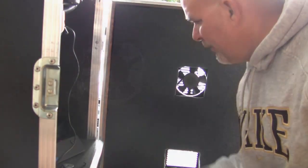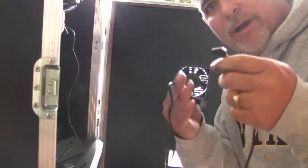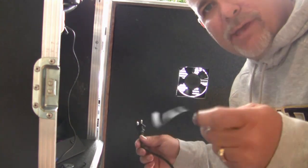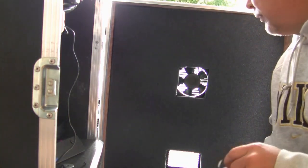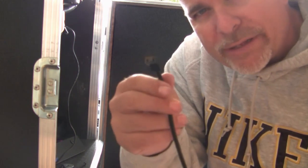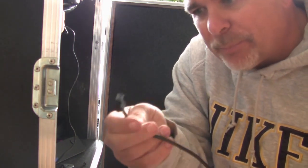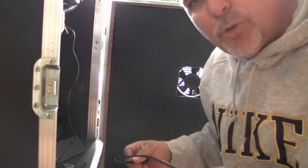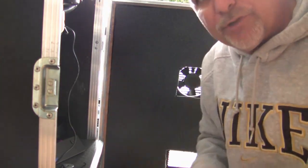Since this is mounted in the door and the door is removable, we're going to have to come up with a mounting procedure to mount the cable and still be able to disconnect it and remove the door when needed. This particular fan is pretty cool — it has a small Molex plug right on the end that plugs in. So I can just run the power cable behind the door, and when I need to remove the door, pull the foam back and just unplug it. Pretty simple.